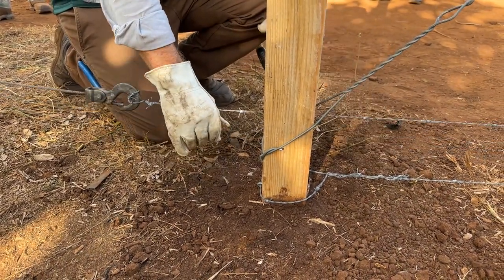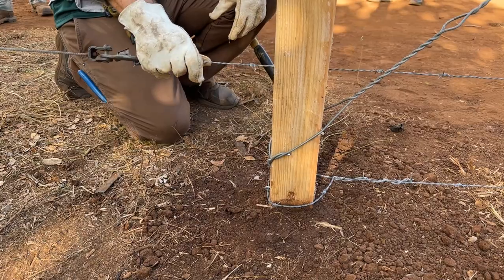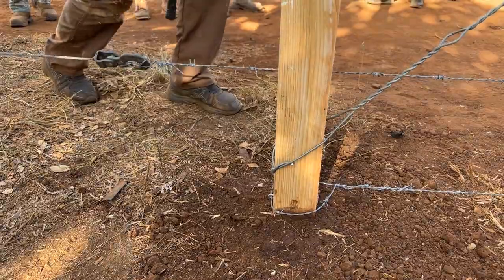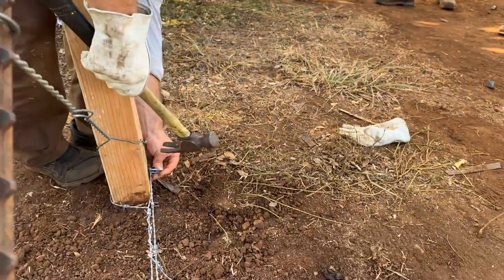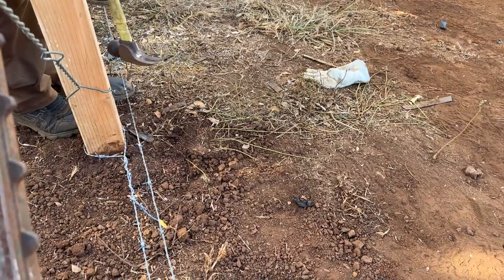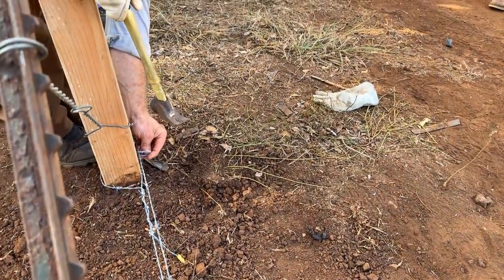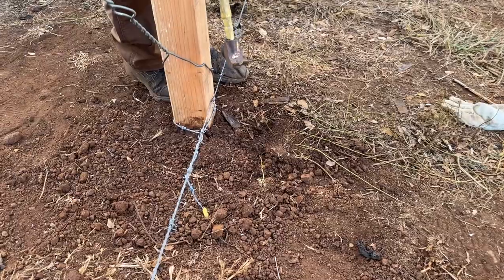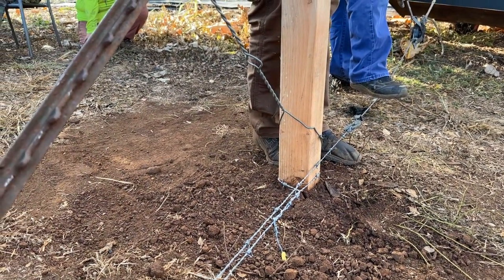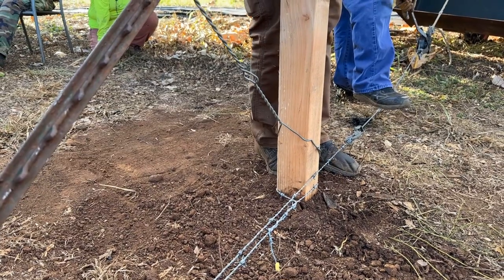I like to come down and feel it — that's feeling pretty good. You can go a little tighter. And then when you're putting a staple in on the barbed wire, I like to put it — whichever way, when you release, the wire is going to want to go one direction. So put your staple in on the direction where it's going to catch the barb.